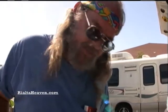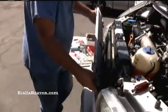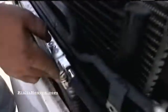It's actually a notch down in through there. You can knock off the little pieces of plastic. If it's in the right place and you did it right, the cooler should just slide right down in there and that hose clamp should fit the notch. Occasionally you have to fine-tune, but occasionally I get lucky too.